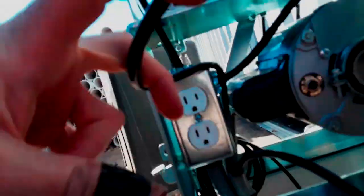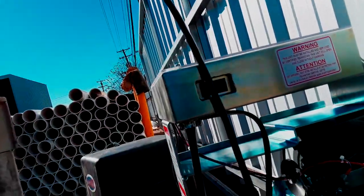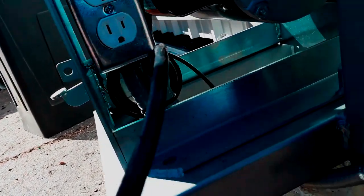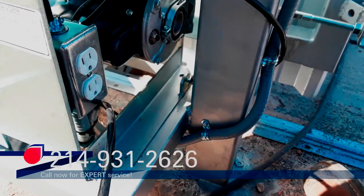Behind it right there - that's coming from the receive side and the receive side is just going to have power, so just two conductors. This wire coming out for the transmit side keeps going because I actually have to get all the way up there with one pair of wires, and I'm only going to the outlet with another pair - that's why it's a little bit longer. We'll cut off what we don't need. The hole that has the coaxial cable drilled at the bottom is going to be covered by the conduit - it's a pretty big hole you need for the F-connector, but it's now covered, so standing six feet away you won't notice it.